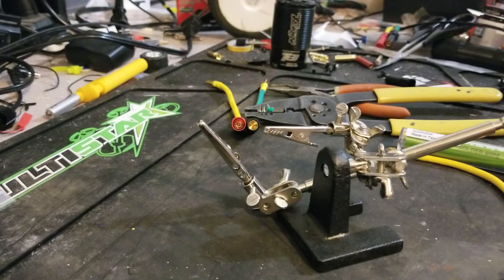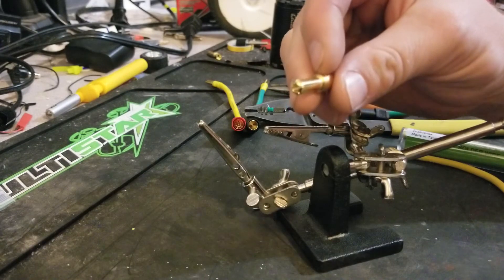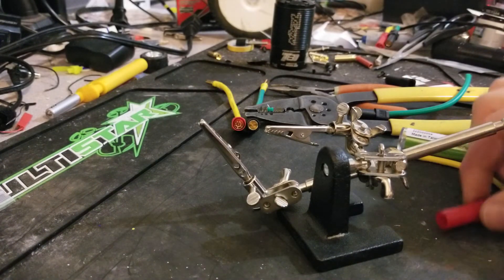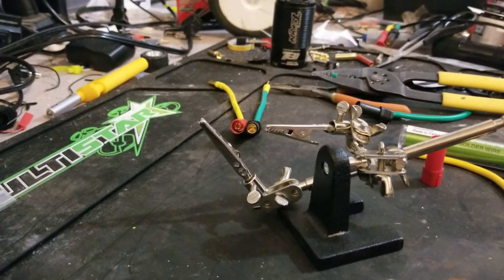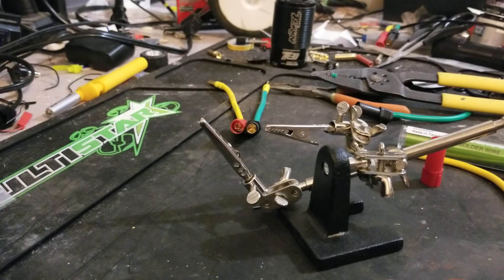With the positive side, you do the same thing except with the bullet and the larger side. Of course, you'll do the reverse of that when you do the battery side. This would be for the ESC side or charger side. These XT60s can be a little confusing and I noticed there are different ways that people like to put them together. I went based off of the Hobby King charge lead that is pre-made, which I didn't buy because why would I spend $7 on that when I can make one for about a buck.